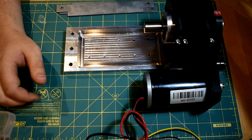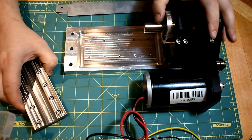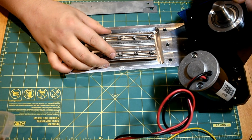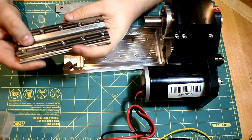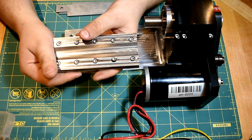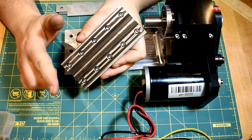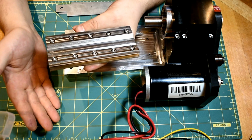Let's see. Oh, so this is the Dovetail. Incidentally, I should add that these were both manually machined, so this still remains a manual machinable project. This is made out of a stainless steel called 17-4. That's the same stainless steel as the spindle, actually. So you've got pretty good corrosion resistance, but more importantly, you've got hardenability and good dimensional stability.